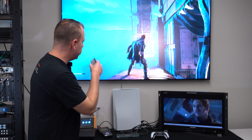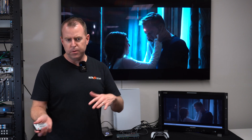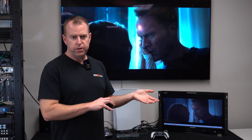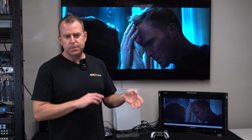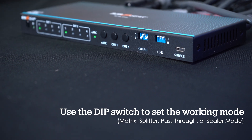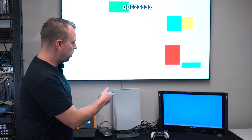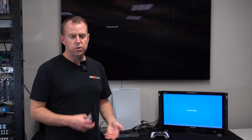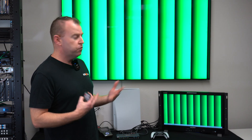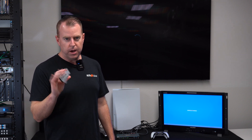If I want to put that on our main screen, I could do that by just hitting the input one button. Another great feature of the unit is the splitter mode. You can do matrix mode and splitter mode using the dip switches on the front config. I could switch between matrix and splitter — splitter allows you to show the same display across all outputs. You switch through your sources and it'll show the same one each time. I'm just going to drop this dip switch down right here. Now they're all showing the same thing, so all I have to do is hit one button and they're both going to switch at the same time. If you want more of a DA distribution application, you could do that — no matrix involved. If I want to show the same thing, I just hit one button on either output and it works.